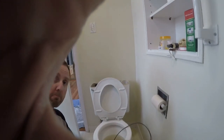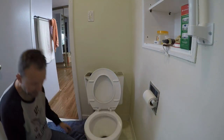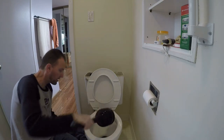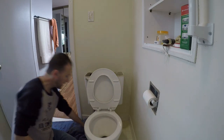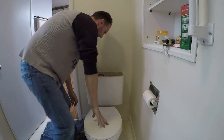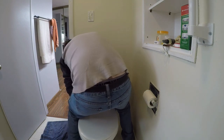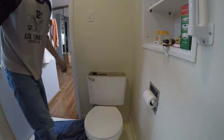I didn't have much luck with the snake going in properly. The toilet bowl wouldn't drain though, so all it takes here is a lot of fast plunging to force the water out instead of sitting here with a cup. Now that it's just about empty, I do have the bowl bolts out - one bolt on each, actually it's a nut. Then you're just using these little finger spots where you gotta break it loose. I gotta undo the water pipe first and then we'll get back to what I was just doing.